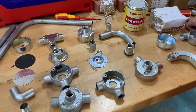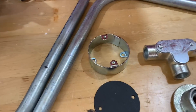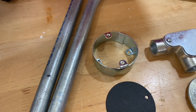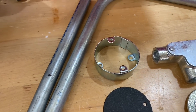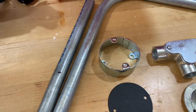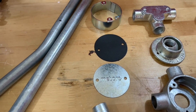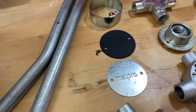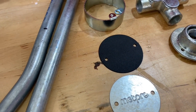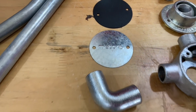This is quite an extensive set of conduit accessories. Starting in the top corner, we've got an extension ring — we can put that on top of a standard box to extend it a little bit further in order to make our electrical accessory connection. Underneath it we've got a rubber gasket, which we use when we're using conduit outdoors to maintain an IP rating, and it goes in conjunction with the box lid below.